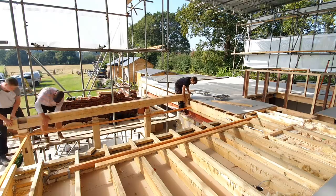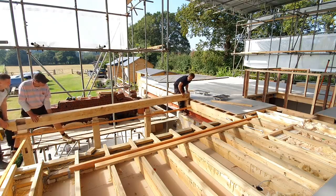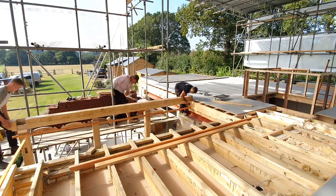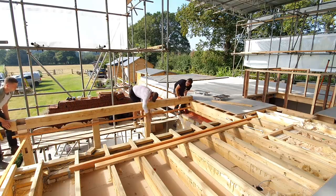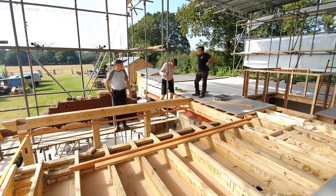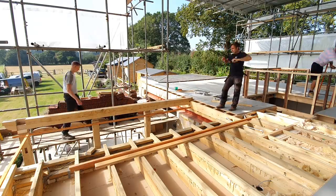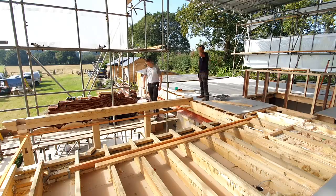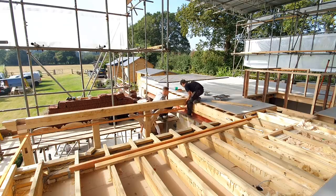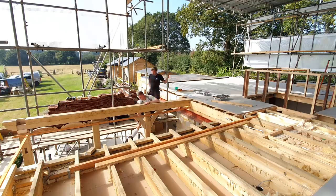Sometimes you can put your frames together laying down on the ground and stand them up if you've got the manpower and safe lifting equipment — that way you can get everything nice and tight with all the joints up. But in our situation with the scaffold, standing it up and threading it through would be impossible because by the time this little bit of oak is together it's probably well in excess of half a ton of material. So we just got on with it, put the braces in, propped the beam up at one end slightly on the tenon, and that enabled us to ease those nice braces in and let it all settle back down, ready for building the roof at the big build.